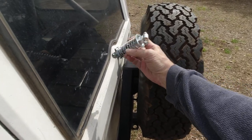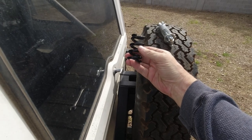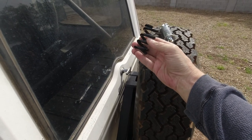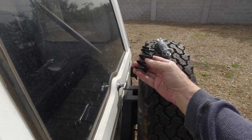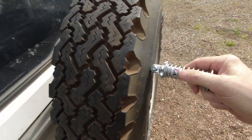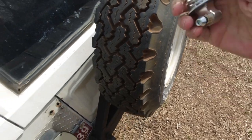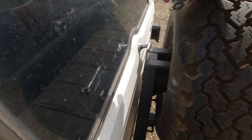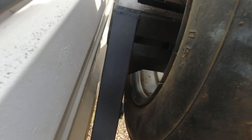And that was this. Now this isn't the spring it came with — it came with this spring on it, and this spring I can stand on and not budge it, so I think it's something like a 500–600 pound spring. It's a bicycle shock meant to go under the seat with a swing arm maybe 12 to 18 inches long, so it needs a really stiff spring. I found this replacement spring down at the local hardware store. I can compress it, but it still has more pressure than I wanted — I was hoping for around 15 or 20 pounds and this is around 30.